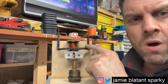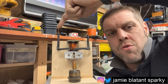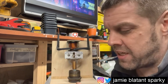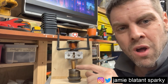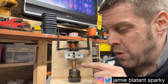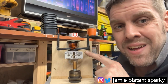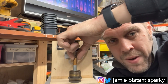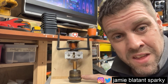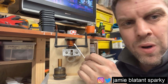This coil here is a wire-wound piece of coil. Rather than using a CT, you put the load current of the motor through it — feed in one end, take the load current out the other — and that effectively makes it into a solenoid. The magnetic field inside will try and pull on this part here, pulling it up, but only when there's enough current. If your motor is a 20-amp motor and you put 20 amps through this coil, it will not try to pull this shaft upwards, so it will not trip. However, if you put 40 amps through it, it will start to pull the piston upward like a solenoid.